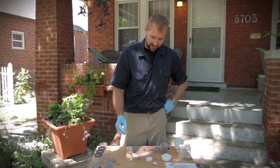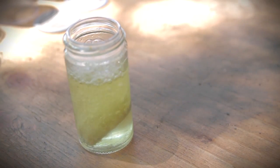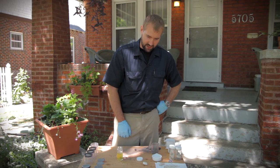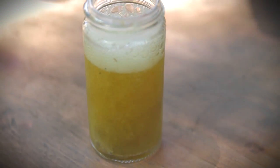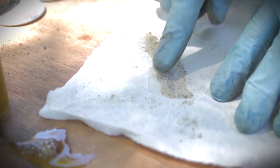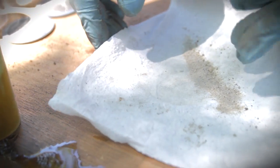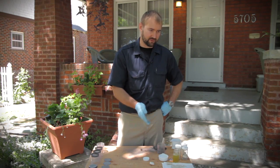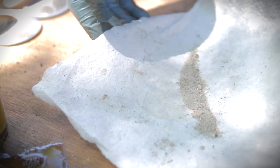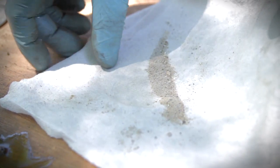You get a nice reaction by dropping the lime mortar into the solution. As you can see, there's a pretty good reaction going on — the hydrochloric acid and the lime are interacting, and given enough time, this will break down completely. What you end up with is the broken-down aggregate by itself without any of the lime or cement that was binding it together. Once you've gotten this sample, you can dry it, and minus the weight of the filter you strained it through, you get the weight of just the aggregate, which gives you the ratio of binder to aggregate.